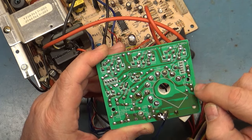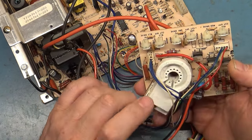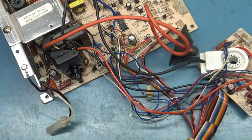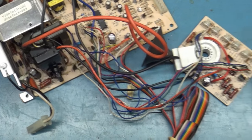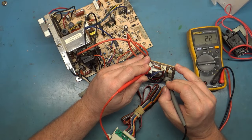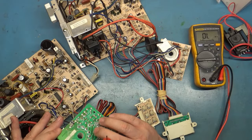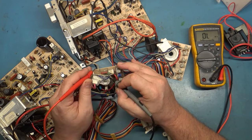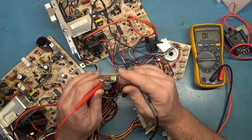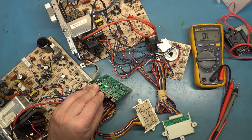What mystifies me is that the silk screen only shows R213. It looks like someone has done some reflow here — very odd. He said he wasn't having the problem until they replaced the neck socket, but I don't think the neck socket is our main problem. This resistor on this neckboard reads 2.2 ohms. On the other one — voltage always takes the path of least resistance, and this resistor is parallel with the first one — it reads 1.0.